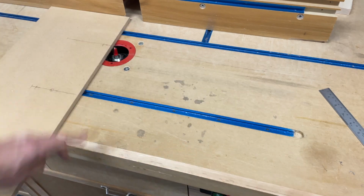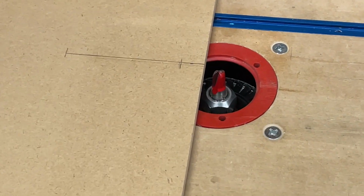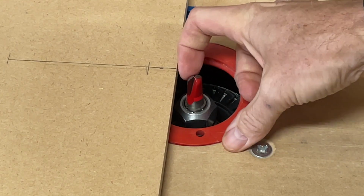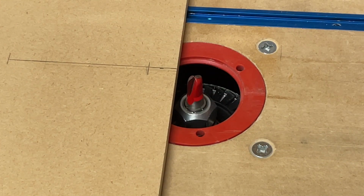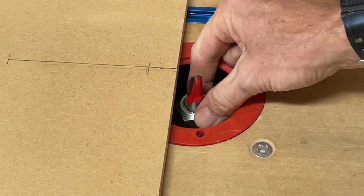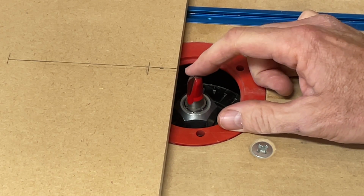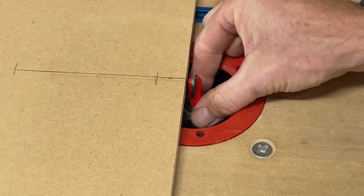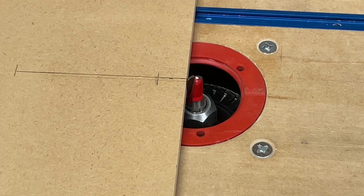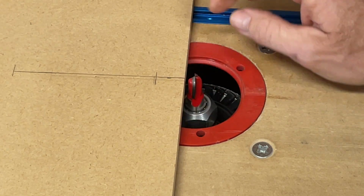All right. If you have to make plunges into wood, a lot of times you go with a straight bit, but try this. This is a 1/2 inch fluting bit. So essentially, if you're going to make flutes and pilasters or something, these actually do really well cutting when you plunge, because they're designed to plunge. And one thing that's nice about using this is that it's got a center point that's really easy to see. There's a little line right there, and it is making it so easy for me to see that center.